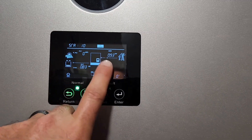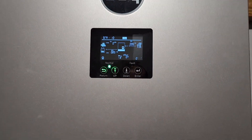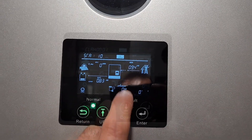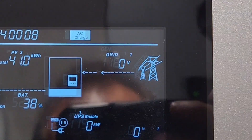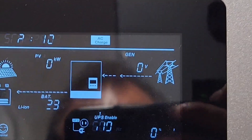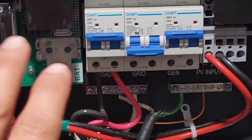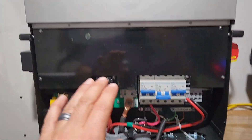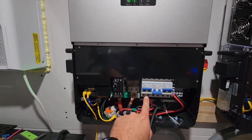That's going to be less than 20 amps because I set my generator limit to a thousand watts. You can see we're pulling in on L1 gen, and there's your L1 voltage — 120 volts — and gen 2 is zero volts. So at 120 volts, I can charge from a generator.